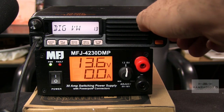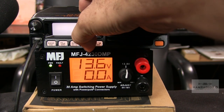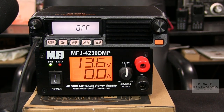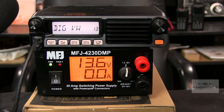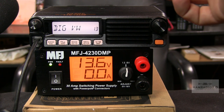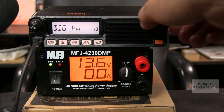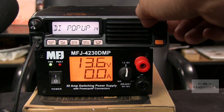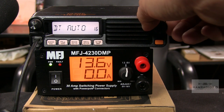In the menu there's DCS, digital AMS — and there it is: digital voice wide, off. I can set the voice wide there. Instead of doing digital narrow DN mode where it does 6.25 kHz in voice and 6.25 kHz in GPS, you can turn it to voice wide so that it takes up the entire 12.5 kHz spectrum with just your voice transmission.